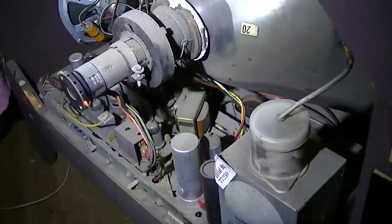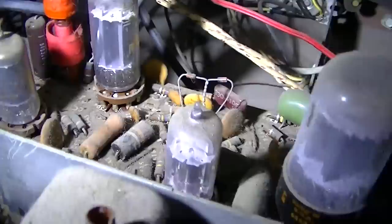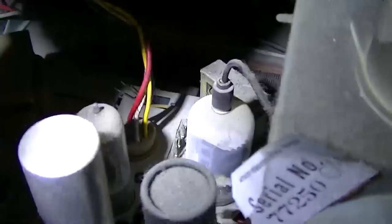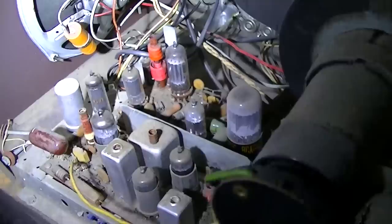All right, here's my KCS136. And this thing is so low hour, it's got all the original tubes in. What's kind of bizarre is the horizontal phase detector selenium diode has been replaced with those two, like 1N917 or whatever, those little silicon signal diodes. This thing's actually got a factory RCA horizontal output tube in it. Which is pretty amazing. I mean, that means it's incredibly low hour.